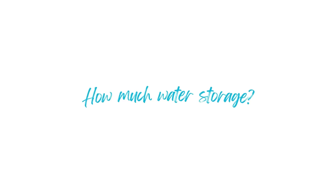If you're looking for a long-term solution, you might want to invest in polytanks, which can last for literally decades. We showed you one polytank which is 2,000 gallons. If we wanted to switch completely to polytanks, we'd need about five to get our 10,000 gallons of water. Water needs are different for different people, but we manage well on 10,000 gallons. We have four months of dry season in Ghana, and our storage is enough to take us through it — we use about 5,000 gallons during the dry season, so we have twice what we need, because mistakes happen: people leave taps flowing or you can have a bad rainy season.